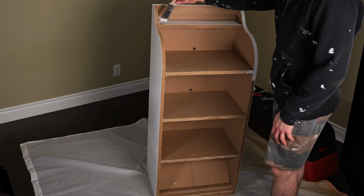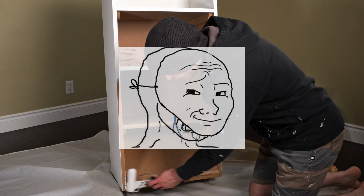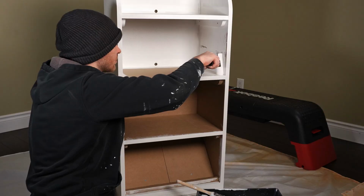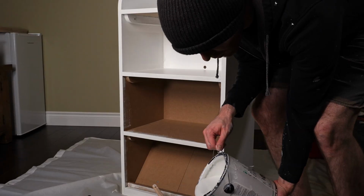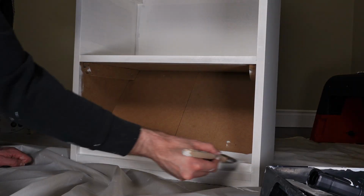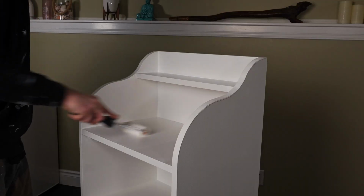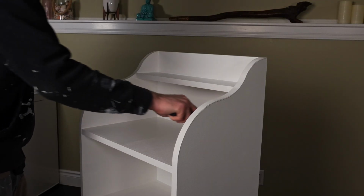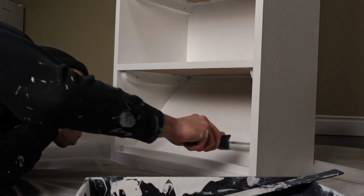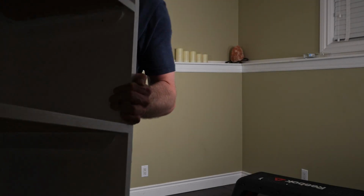So doing this, I'm not gonna lie, I kind of injured my shoulder and it still is sore today, but to lay all of the pieces out individually and paint each side and then flip it would have taken a very long time, especially because I don't have space for all of the pieces at one time. I did what I normally do here, which is 3 layers of primer and 1 layer of paint. It's melamine, which is nice and durable, and that's especially good because after this, I was really not feeling like doing 3 layers of Varathane and sanding between some of those layers. I might end up going back and doing some Varathane eventually, but like I said, melamine is pretty durable, so it's not a huge deal if I leave it.